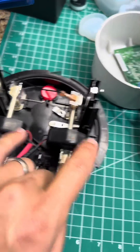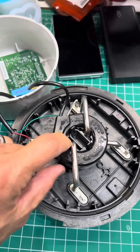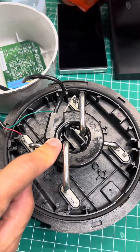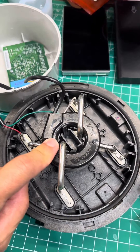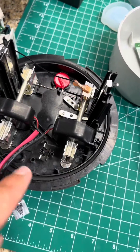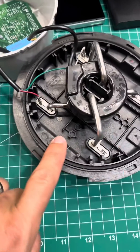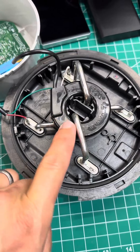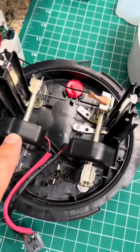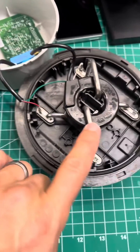Why does that matter? Well, leg A and leg B are supposed to be 180 degrees out of phase, and this thing is measuring what I would assume is the voltage peak-to-peak across both legs, which should always be 180 degrees out of phase in theory. This one over here measures leg A and leg B and then sums them together to figure out your usage. Let's see if these are actually 180 degrees out of phase, because if they're not, there's a good chance the old meter was under-metering, and the new meter is going to be a little bit more accurate — but they're definitely measuring differently.